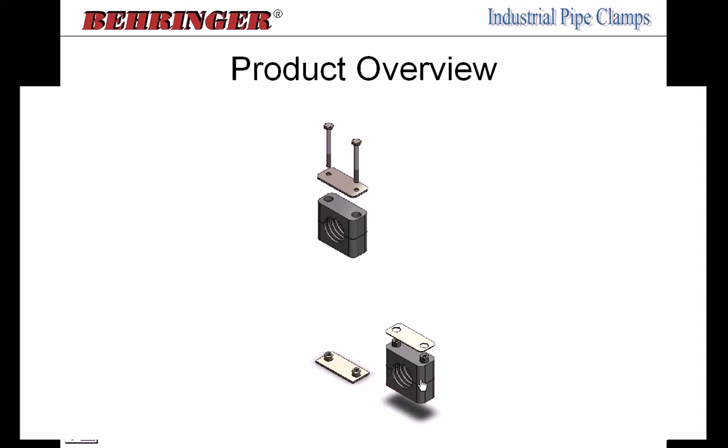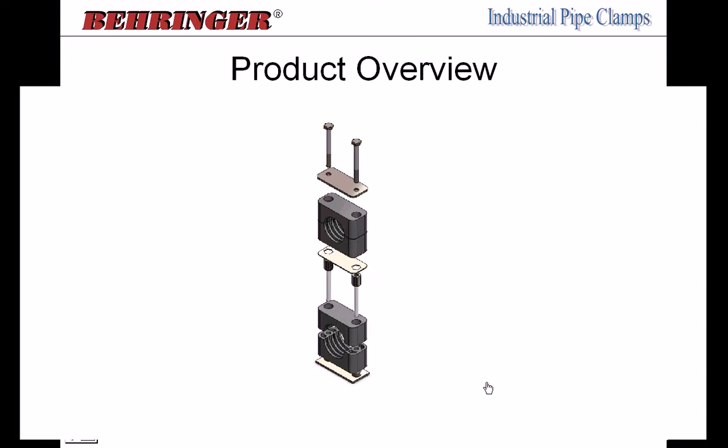and then the stacking kit is everything that you would need to put in here. So now this bottom plate can be your weld plate, as in this example. It could also be your rail nuts, or it could be your base plate, or whatever. This bottom plate, doesn't matter what it is. You take your clamp apart, you slide your stacking kit in below it, you mount your stacking kit down, your bolts, your safety plate goes over top of it.